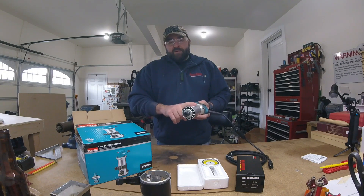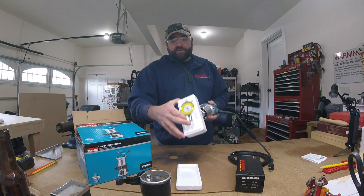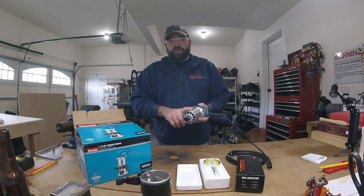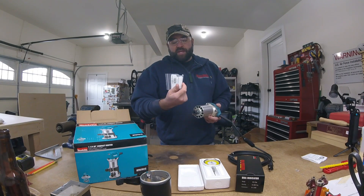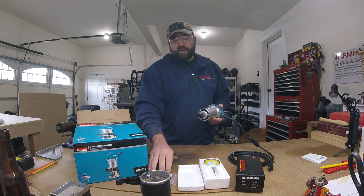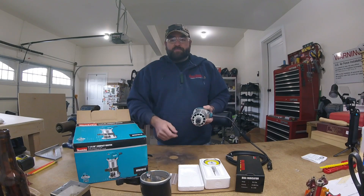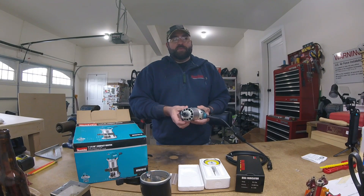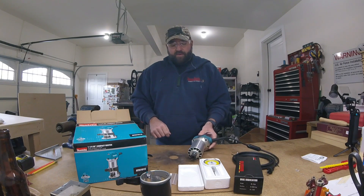I don't have a base to mount to the shaft or outer case of the actual router. I do have a dial gauge that I've had for a while. I had gotten rid of my base — didn't think I'd use it — but I'm going to have to make one. I've got a quarter-inch gauge pin. It's a quarter-inch minus, so it's 0.0002 below 0.250 inches, so it'll fit in the collet and won't affect anything. It should be straight, true, and should not have any issues with runout or eccentricity. Let's make a base to mount that to and we'll see what it is.